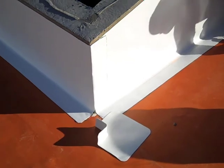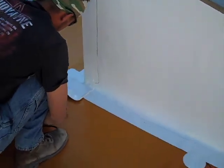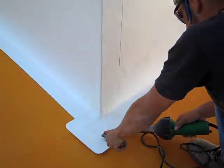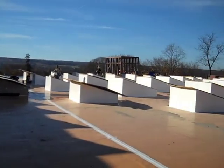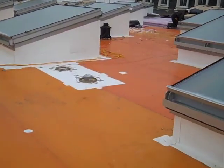Specially prefabricated corner pieces are heat welded into place where the skylight walls intersect the orange membrane, providing a continuous waterproof seal. Other circular pieces provide added protection where roof membrane seams intersect the vertical flashing. To complete the roofing membrane, once the horizontal roof surface and skylights are covered, the building edges must be finished or flashed.